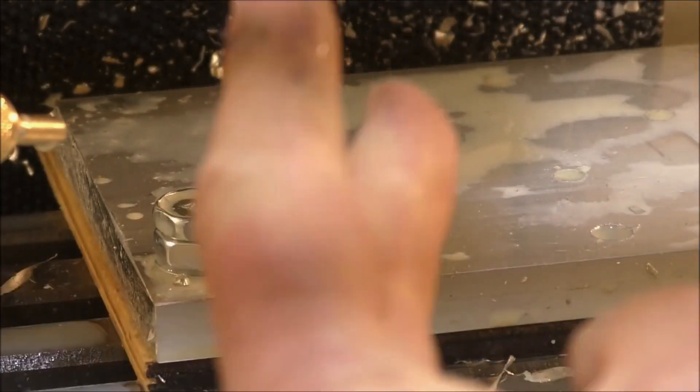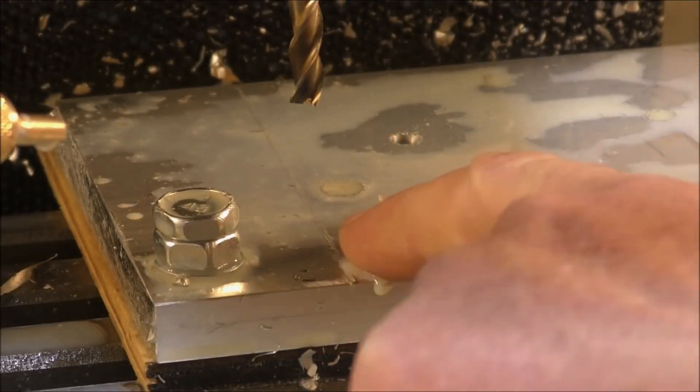This one's a little bit more interesting. This is a six millimeter end mill, it's a three flute, and what we're going to do is five holes — we're going to make a countersink hole about six mil deep, because I need the heads to be flush with the material. So that's the next job.